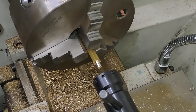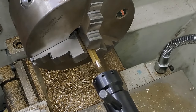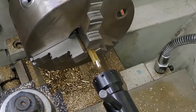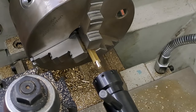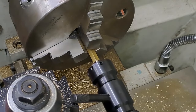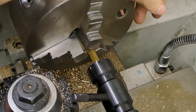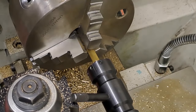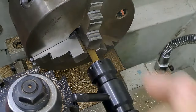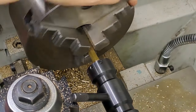And you can just disengage the lathe a little bit. Let's move this up to give me something to work against. Now, as we've done before, we're going to let that handle rest against there and we're going to get this threaded M6. So pop the tailstock down, turn the chuck this way, turn the tailstock handle the other way so it actually pushes those two together. And then when we hear it squeaking, we know we're biting.